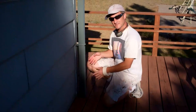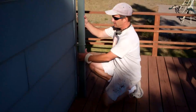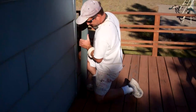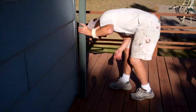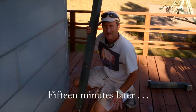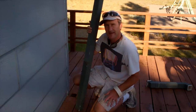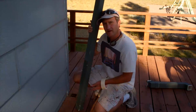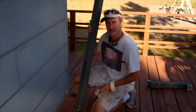If you've got one of these downspouts that's actually cut right through the deck, usually you'll need to dismantle it down below, dismantle it up above, and then figure out a way to — sometimes you've got to kind of bend it and maneuver it to get it out of there. It can be a little tricky. Don't do damage to the downspout. If you can't get it out of there, just leave it in place. If it's a factory-finished downspout, you'll have to cover it with some tape and paper, and if it's a painted downspout, you'll just have to paint it in place.